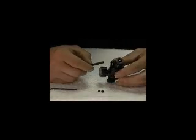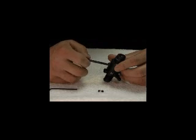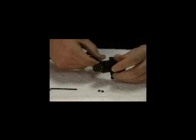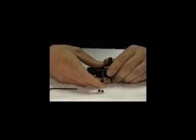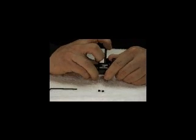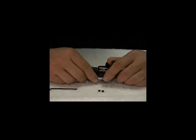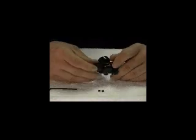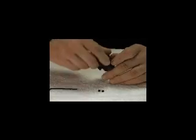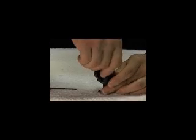Insert the bonnet removal tool and turn the tool in until it stops, and then back the tool out 1/4 of a turn. Next, hold the bottle or the reg and turn the removal tool counterclockwise to lightly loosen the bonnet. Remove the tool, as the bonnet will now turn by hand. If the bonnet does not move easily, verify all the air is released from the bottle. Then, holding the system straight up, remove the bonnet completely from the reg and set to the side.